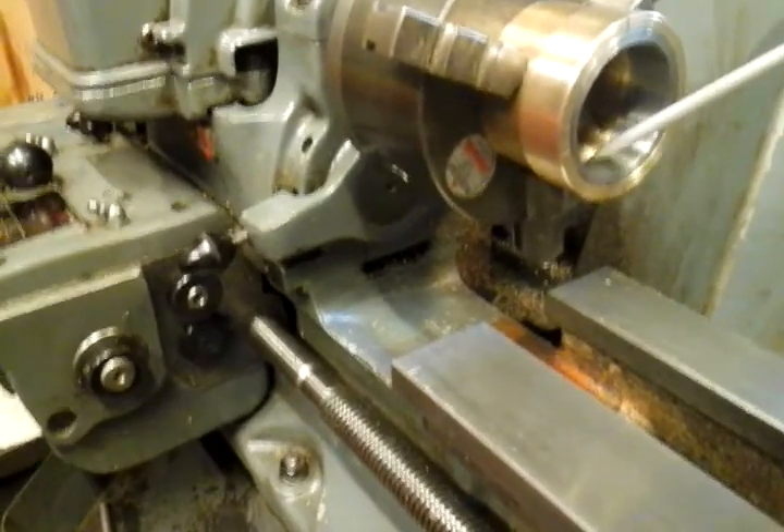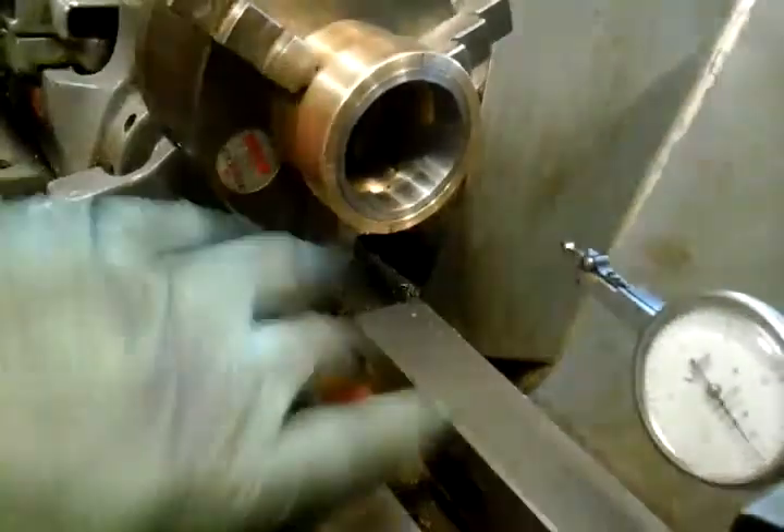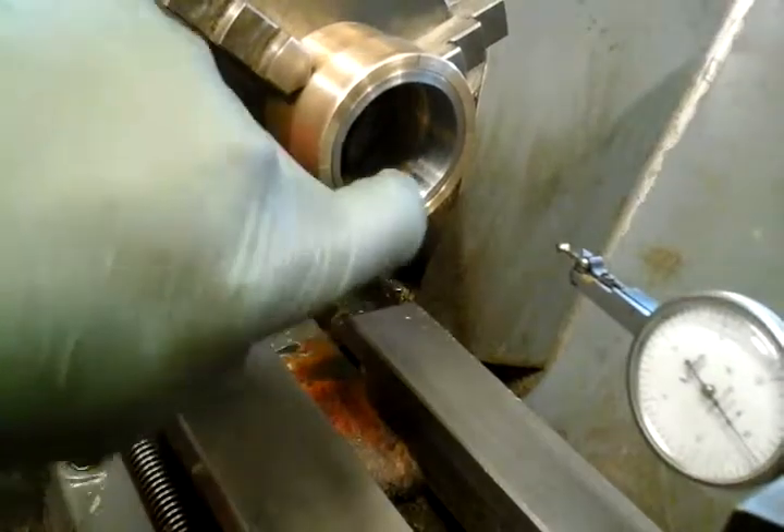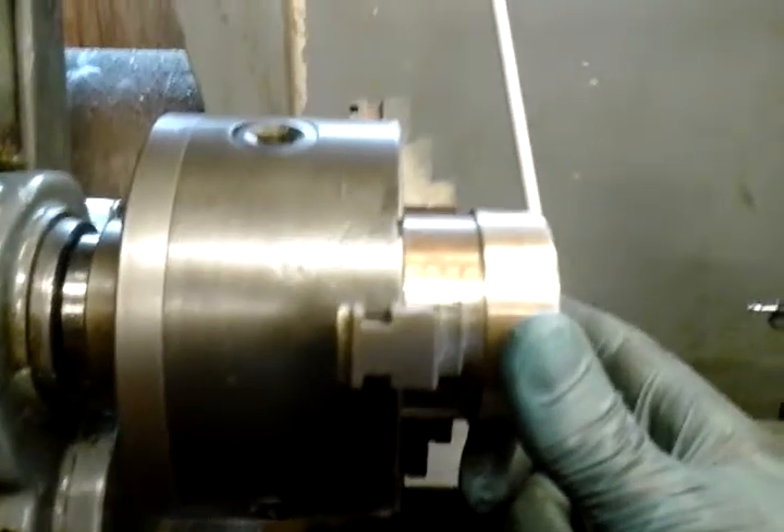There's the peg and it's set at full advance. I set my lathe exactly vertical to the centre line of that peg. I've fitted a degree disc at the back and made a pointer so I can get an exact reading. When the fixture in my lathe is set at the vertical position, I set my degree disc to zero. From that point on I can get all the degrees of where these cam lobes are by moving my clock indicator.